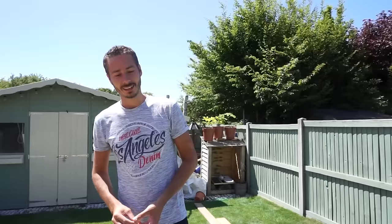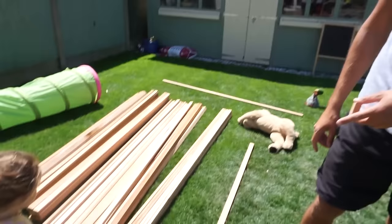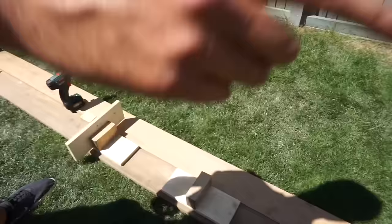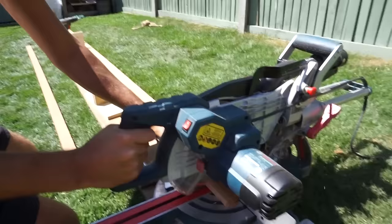We've just finished chopping off about a centimetre off of each batten, so now we've got a nice clean edge to work with. It's time to cut the first half of the fence to size. What I've done here is set up a little stop block, so each batten will come up to here, rest against here, and I know this is the perfect distance between the blade and the end. All of our battens are now cut to length.